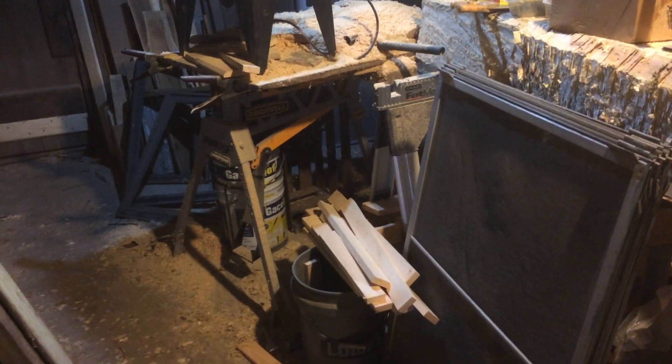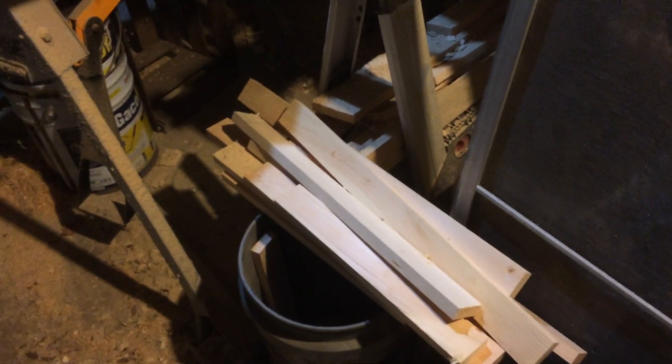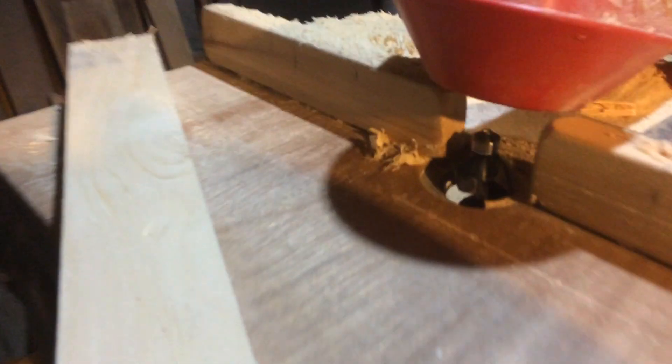I'm doing a thorough video on molding. I've been adding Eastlake molding to many places in this one example. I took short cut-off pine boards left over from other processes and ripped them into about two-and-a-quarter-inch strips — you'll see why later. I have a router bit here that's just a 45-degree chamfer, set to take a chamfer edge off going this way. So let's go outside and I'll show you more.